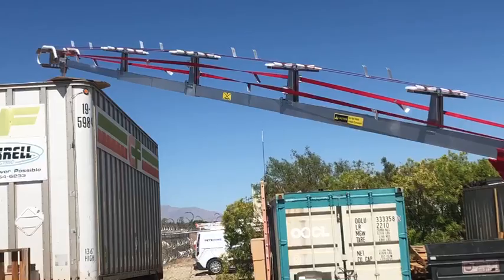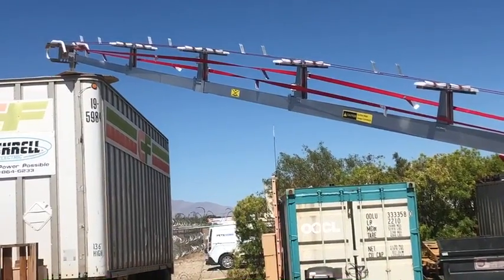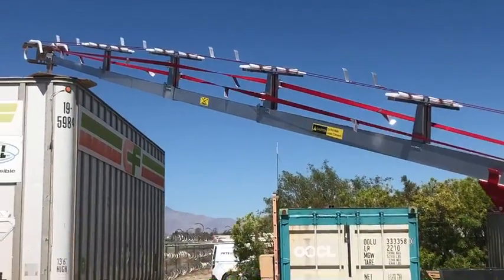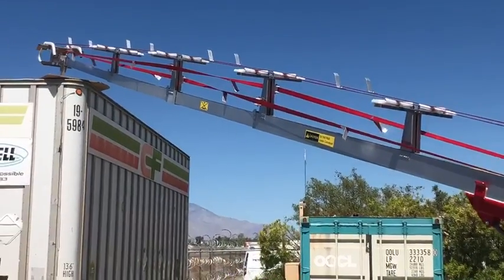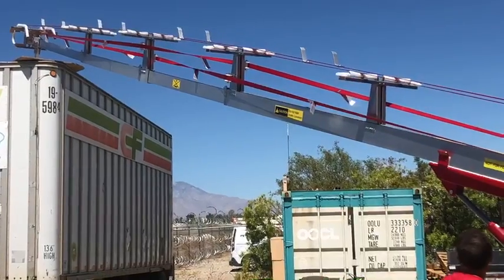Ease it down and get 15, 20, 25 pounds of pressure on that nose. There should be a slight arc — all machines act a little different — but a slight arc in the bottom rail enables you to run this machine all day long, forward and reverse, loading tile and shingle.